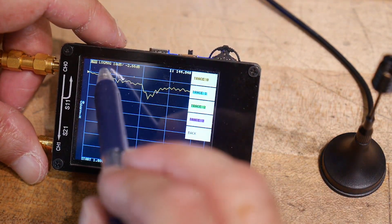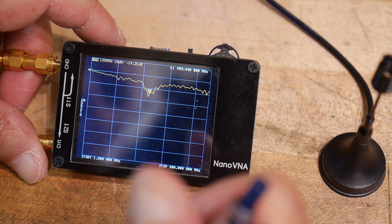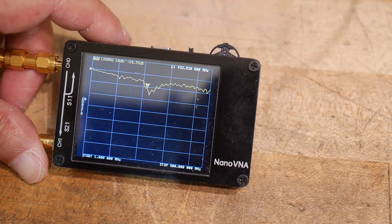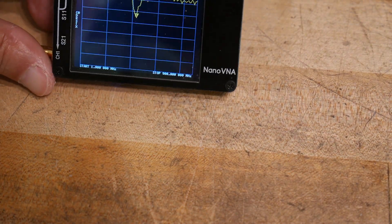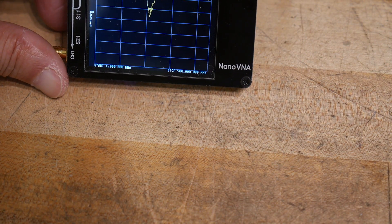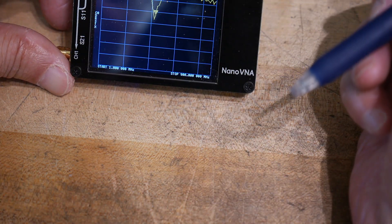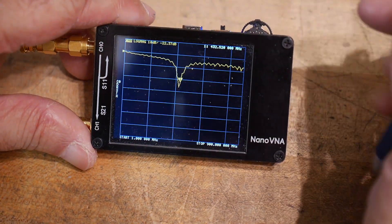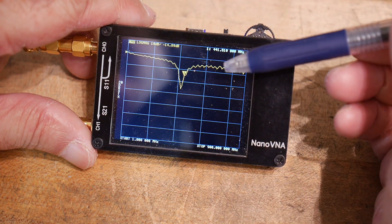If we drag the markers down here around 460 — let me stick it on something metal so it has a ground plane. There we go. It works better with a ground plane. And we can see it's dipping here around 432 and here at 441.5. It's okay.